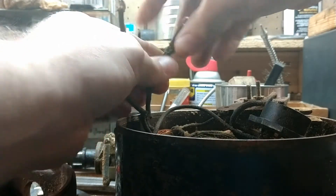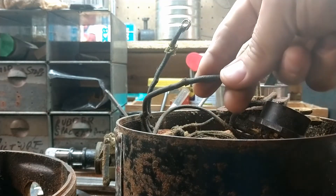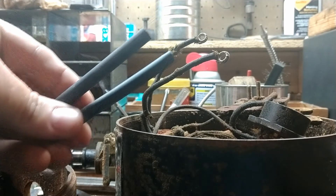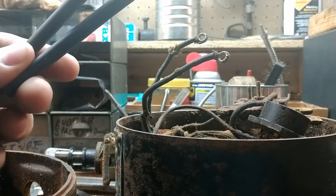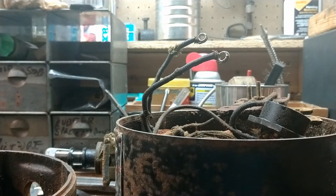I don't really feel safe using those just the way they are, so I wanted to fix them up. I couldn't find anything on YouTube about how to fix these wires, so I went on to the vintagemachinery.org forum and was able to find a solution using heat shrink tubes — putting those on there to replace or add further insulation.